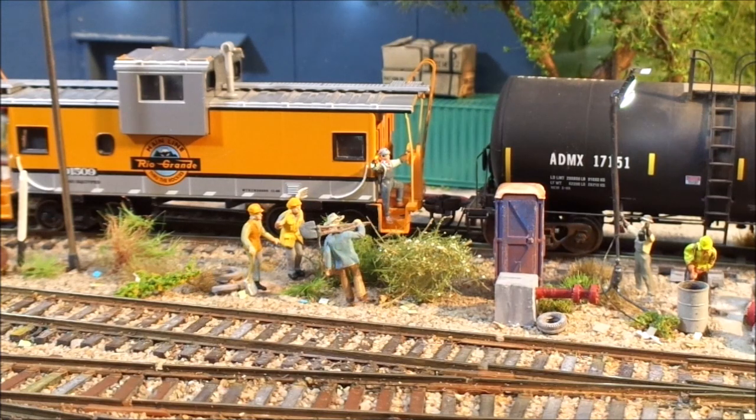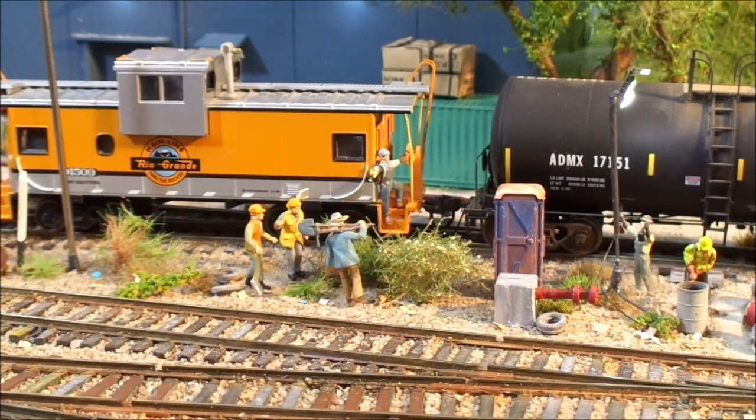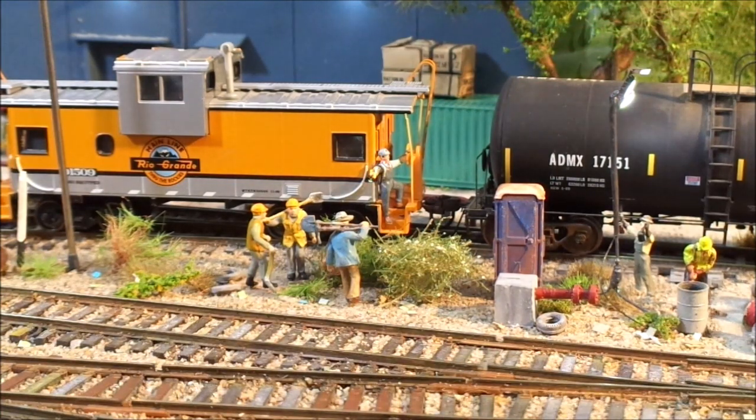Having a figure actually on board the caboose, having a wave with his working lantern — it's an 0402 LED and a little tiny glass bead to make the hand lantern. Wires are run up his arm. I've got a TCS FL4 inside there working all of this, and a 1000UF capacitor.